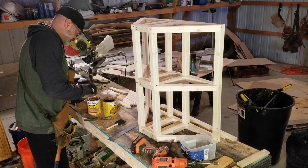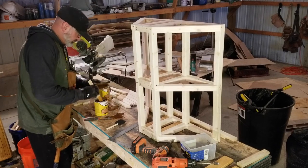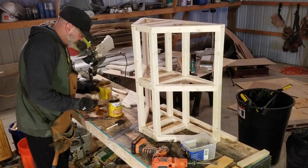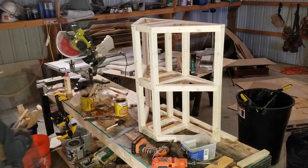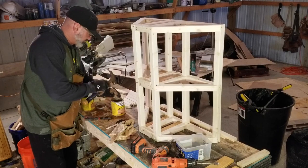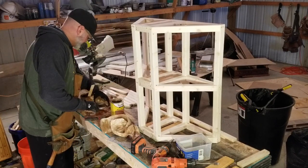Yeah, I know we've talked about this before, but the new Varathane stain replacing Minwax at Home Depot has lumps in it usually. So to combat that, I usually keep the old can and get the new can and then split half and half and mix it back and forth, making sure I get all the lumps out and that it's mixed evenly. That seems to work pretty good.